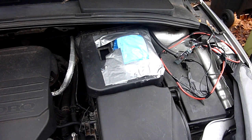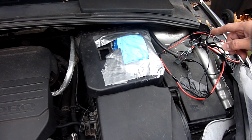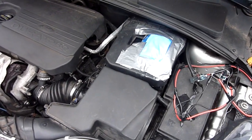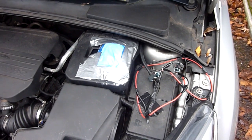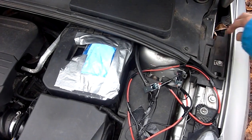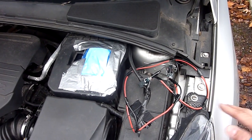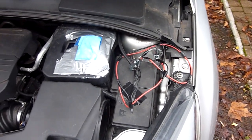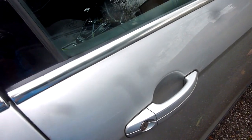Once the car is asleep — about 40 minutes — it should be drawing 20 milliamps or less according to the handbook. I'll connect to the ammeter at 11 o'clock. I was going to jack up the car and swap wheels around but I won't do that because I also have a TPMS sensor error I'm dealing with separately. Moving the car might kick off sensors while it's trying to sleep, so I'll just let it sleep properly. I'm also double-locking the car.